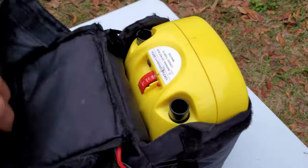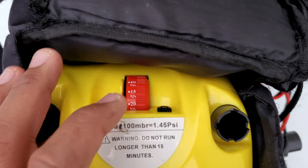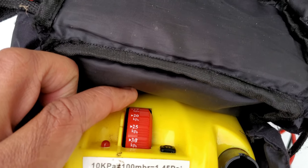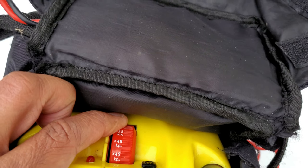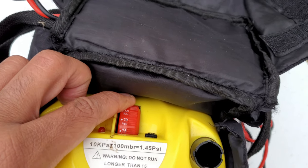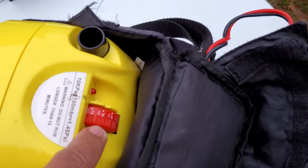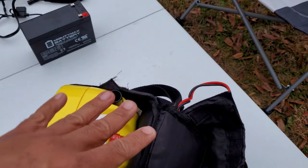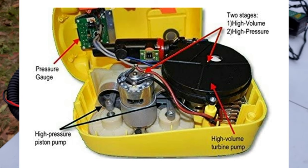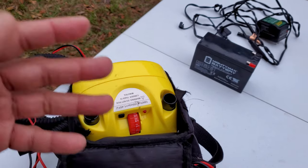This one is not digital — it's plain old analog. It has this dial right here that only measures KPA. The main bladders for an inflatable boat like Saturn use 25 KPA, the keel uses 40 KPA, and the floor itself uses 10 PSI or 70 KPA. It automatically shuts off — that's the beauty of it. You set it to the KPA you want, turn it on, and let it rip. It has a big turbine pump which inflates the bulk of the bladders, and then a smaller piston pump which creates the higher pressures.